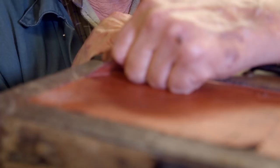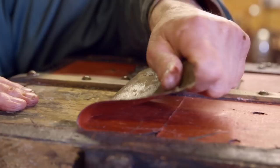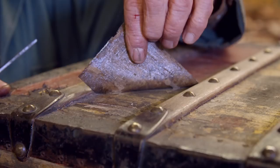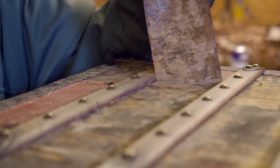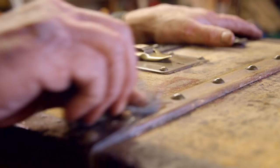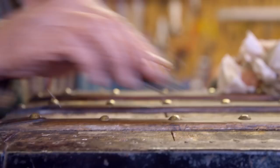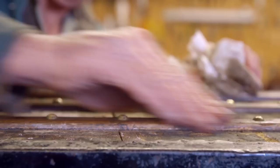As this canvas layer is non-original, Martin is removing it to replace it with a color more in keeping with when it was first built. It looks a complete and utter mess now, but you wait for the magic to start. I clean the woodwork with wire wool and white spirit — it'll just take off any surface soil gathered over the years. This was made in the days of coal fires, days of steam travel, so consequently any handling it had by porters and people was always absolutely manky.